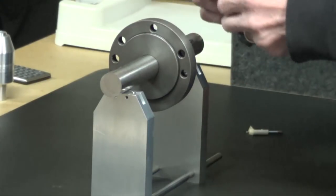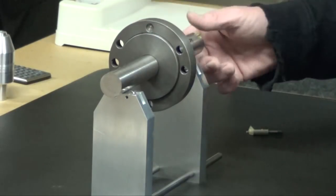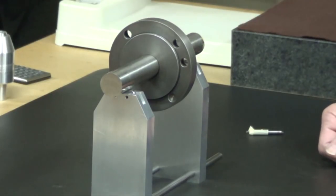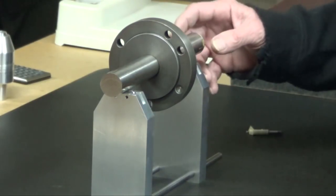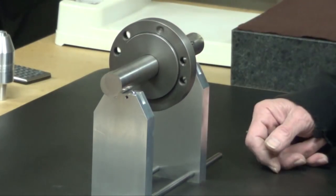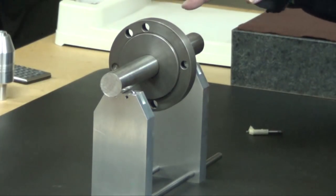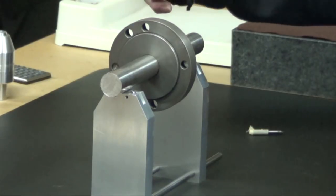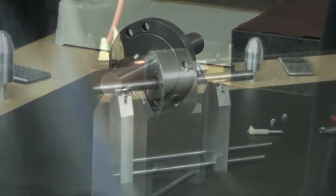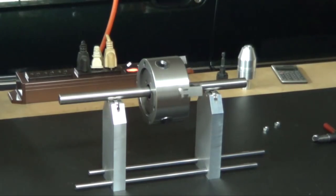So the little balancing slug that I talked about, put it in there, and guess what? It's in balance. So I've got that guy right, slightly off maybe. This is a crude piece of stainless. I haven't polished it or anything. But it looks like this guy's okay, or close enough that when I add weight to the chuck, I can compensate for any minor issues here. Just great. Not sure how I'm going to fix that without the adapter plate.